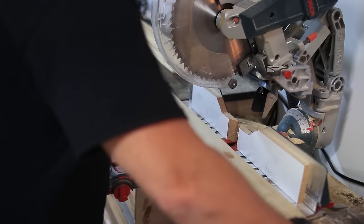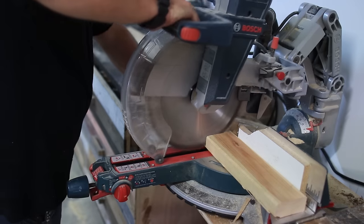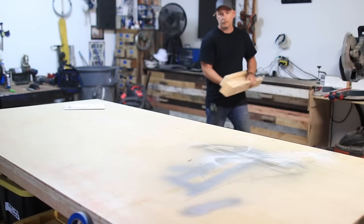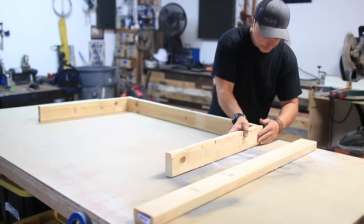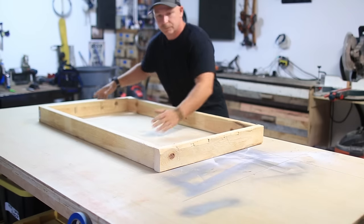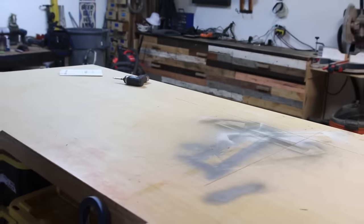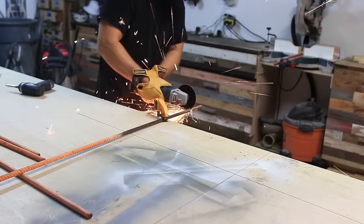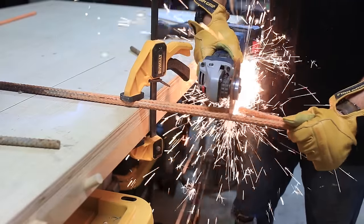Now I've got to make a form for the pad, and then lay out where the actual outside unit, the condenser, is going to go. To make the form I'm using some scrap 2x4s. One thing I've learned when making concrete forms is that you've got to make sure your lumber is good lumber, because if you have chunks missing out of them, the concrete is going to take its shape. Then to give the pad some strength, I found some rebar in the attic and cut it into a grid to make a ladder, which should keep that pad from cracking in the future.